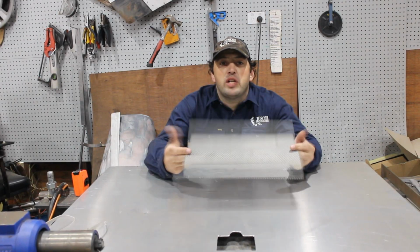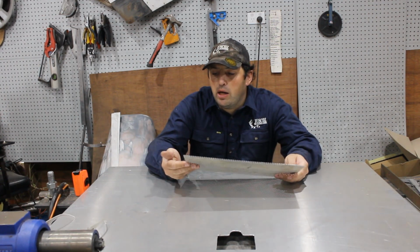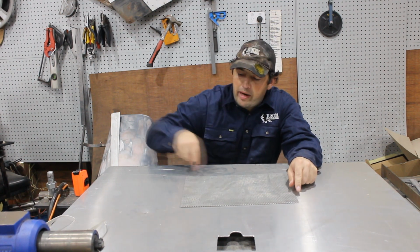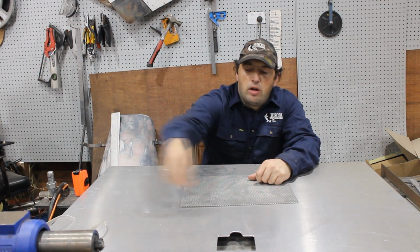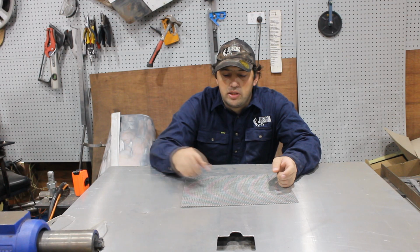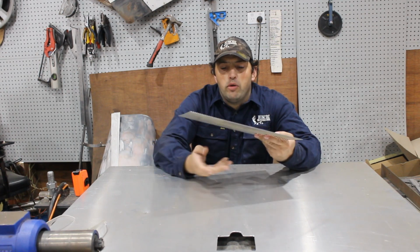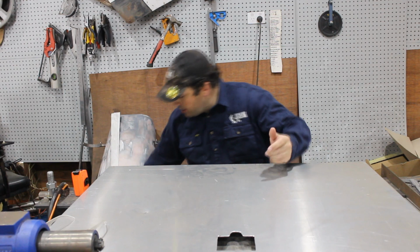Alright, so, back in the shed quarters, I found a piece of punch metal, so we're going to make the tray for the drop saw. Now, this is stainless. It's going to have a stainless edge all the way around it, about 40 mils high, and a little edge off of that to sit into the box. Now, this is meant to catch all the chips from the saw blade, and then all the cutting fluid falls through into the catch tray.